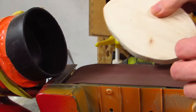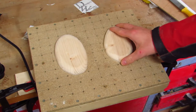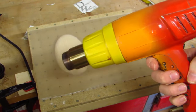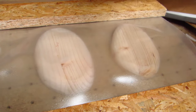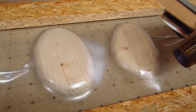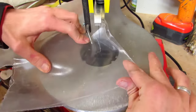This one will be elongated and not symmetrical. Now we need a vacuum table, which is a sturdy box with holes. Place the plank on the side with many holes and make sure it stays there. Take the piece of plastic, place it on top and heat it up with a hot air gun. If you want to use this technique more often, you can put the plastic in a wooden frame, heat it up in the oven, and then place it on here. Once the plastic is flexible, turn on the shop vac, connect it to the hole at the bottom of the box. Give it time to cool and harden, then you can cut it apart and remove the overhang.